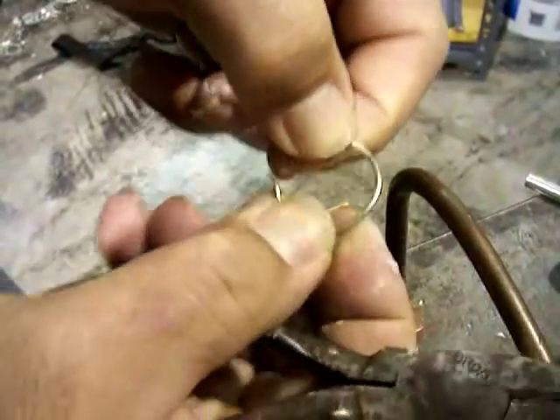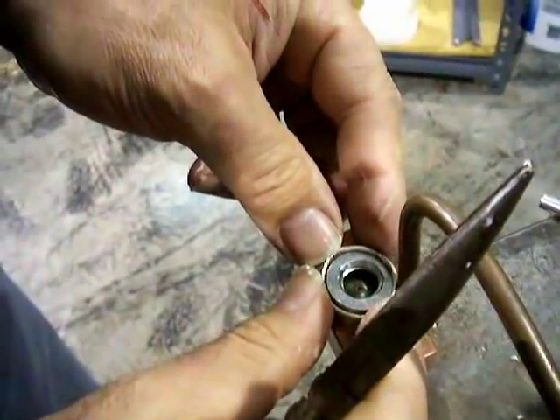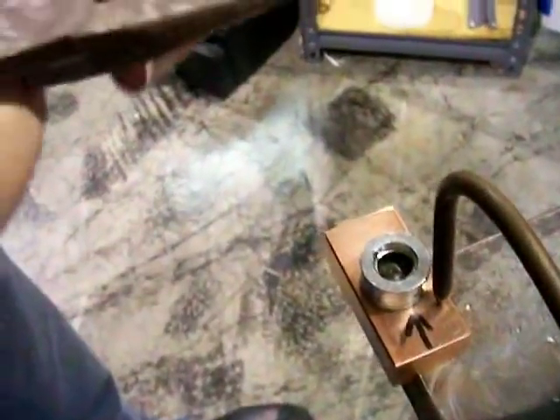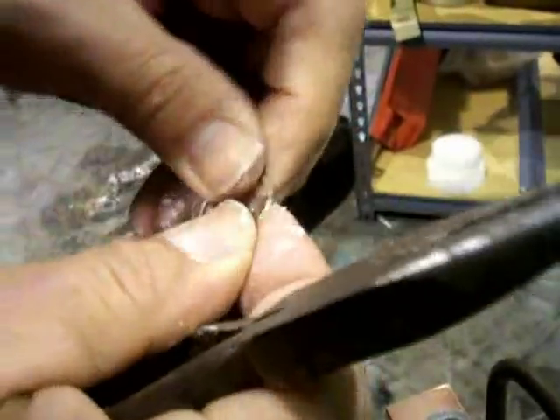Also on this little swivel foot — this is a carbon steel swivel foot. It had some zinc coating on it, and we skinned that off because we don't want any extra problems. I'm going to bend one for that too. This is going to a copper block with a little recessed area in it, and I know that copper is going to take a lot more heat to heat up than that piece of carbon steel.